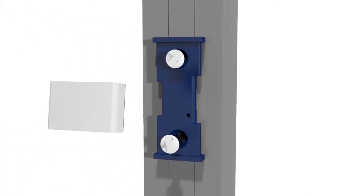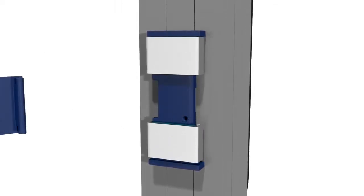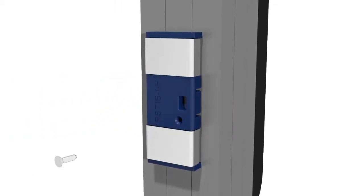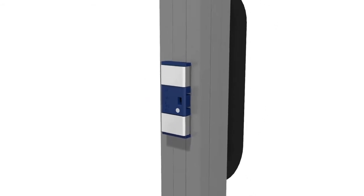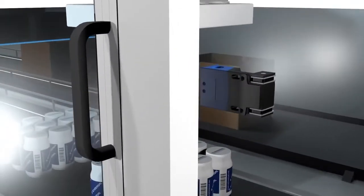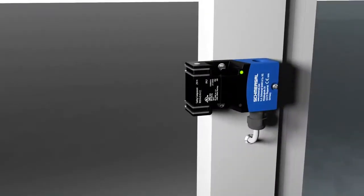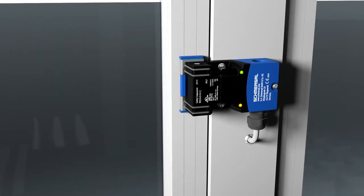After assembly of the support plate, first slide on the stainless steel base plates with shock absorbing pads, then flip on the guard clip and push in the pin for manipulation protection. With operation from the bottom side, the RSS16 is mounted on the door frame without the attached shim. The damped magnetic latching acts in the same way as a door stop, and this combination allows all-round offsets of two millimeters in a single assembly unit.